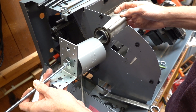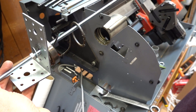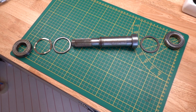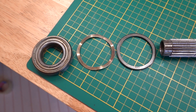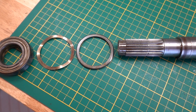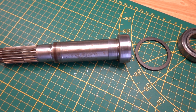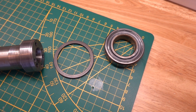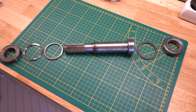I used a similar contraption to pull the rear spindle bearing from the headstock. These are all of the parts in the correct order: the bearing on the backside, a spring washer to provide preload to the bearings, a spacer, the spindle itself, another spacer, and the bearing from the front side. With this arrangement, both of the bearings will receive a preload force from a single spring washer.